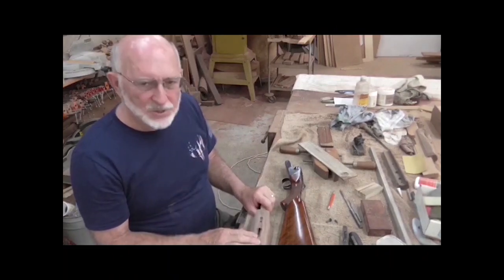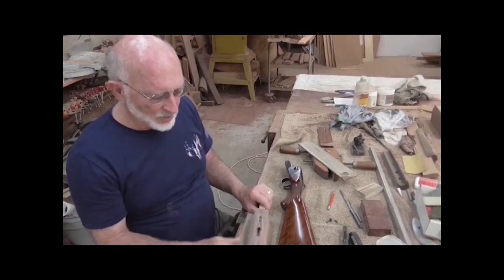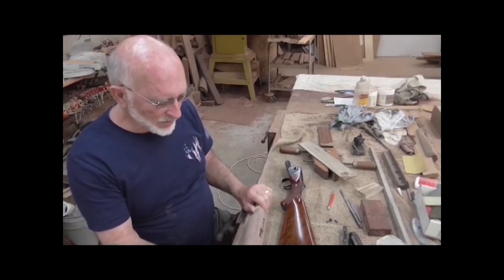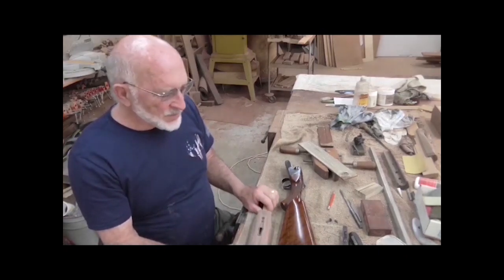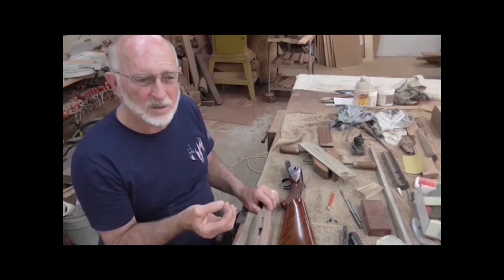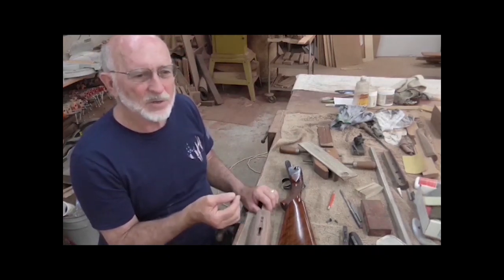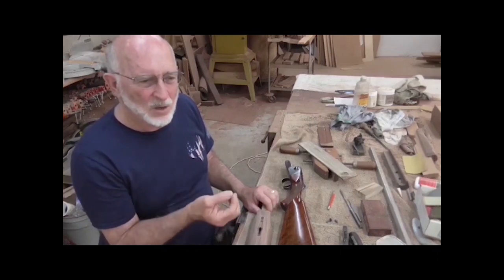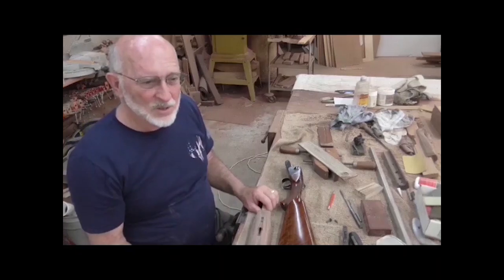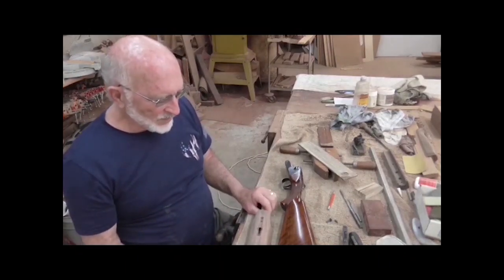in between coats, I would sand it with 400 sandpaper because it would raise the grain so bad. It would be so rough that if I left it that way and stained it, it would soak in really, really deep. And I played with some yellow stain, took a little red tint coloring and put in it, tried some other red stain. That had too much of a brown to it. So I just took plain yellow, just primary color yellow, and put it in with some yellow stain. Made some stuff that wasn't a whole lot different than UT orange, basically. But it's a stain color.